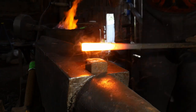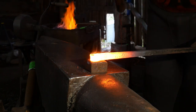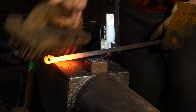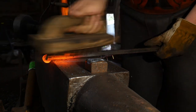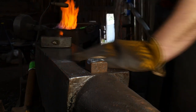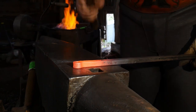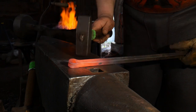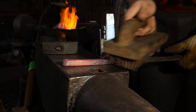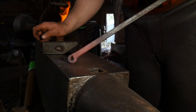That screaming hot white heat is a full welding heat. You'll also notice this was not sparkling all over the place — it was not a ball of fire with a bunch of sparks coming off of it. If you have that, you have too much oxygen in your fire and you need to reduce the oxygen content by turning down your blower or not cranking so hard on the handle. Most likely with mild steel you will have to take multiple little welding heats to dress out any of the scarves you've made in the scarf joints, but that is a pretty common occurrence.